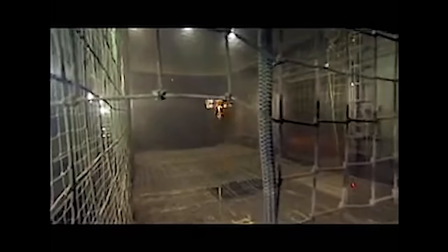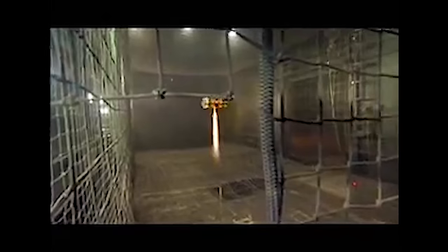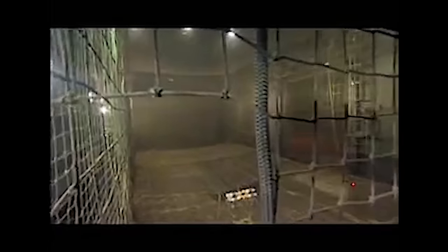This is a test of a KKV, or kinetic kill vehicle — a device designed to take down the warhead from an ICBM while it's in space, which is crazy and very high stakes. It's using pulsed on-and-off thrust from vertical and horizontal thrusters to maintain attitude control and, more importantly, maintain its position in space. It's easy to see why spacecraft use this sometimes, because valves that just turn on or off are lighter and simpler than valves that control flow rate. So if you can make those binary valves work, that's better for your design in terms of simplicity.